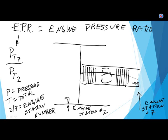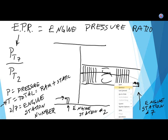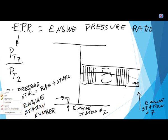So now, as Elizabeth was trying to convince me the day before yesterday, yes, the pressure inside right here, and remember, it says pressure total. That means it's the ram pressure plus the static pressure. If the engine was not running, how much air is getting shoved into this probe here, and into this probe there? Anybody? The engine's not running. How much air is getting rammed into it? 0.